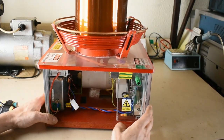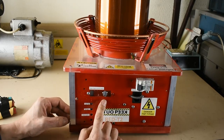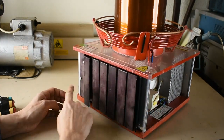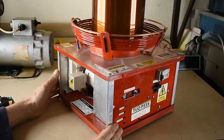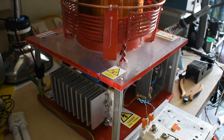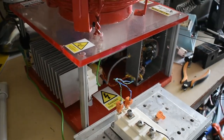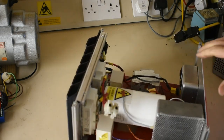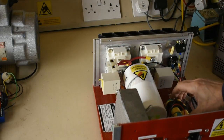It's also had modifications so it can run straight off the mains, and it has a fiber input so we can control it externally. The heatsink — so far I haven't needed to fan-cool these, but that's another mod that may happen. I'm going to try a little upgrade here from half bridge to full bridge, which will probably break it on the way, but we're going to give it a go. It's quite modular so I can adapt and change it as I go on. It now has an H-bridge arrangement with IGBTs here, still running on a battery supply.